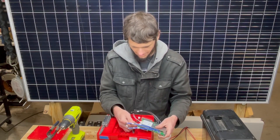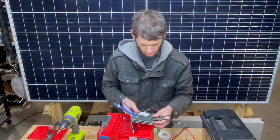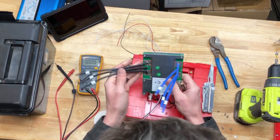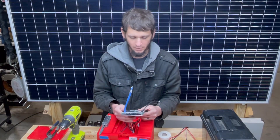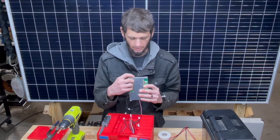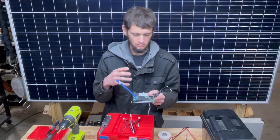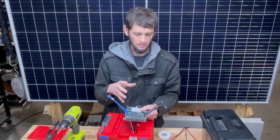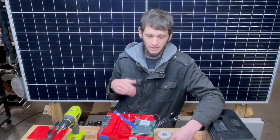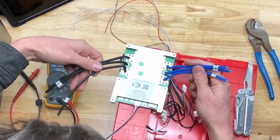Okay, so now I don't think this BMS will boot until the B-minus is connected. With these BMS's — and this is a lesson in BMS's in general — B-minus and C-minus. You can see it's labeled on the circuit board. This is what's called a common port BMS, so current in and out of the battery flows through this BMS. You've got MOSFETs — one row for inflow of current, one row for outflow. You can control only outflow or only inflow, so if you're at full charge with an inverter connected you can still pull power, but the BMS won't allow power in. There are also what they call separate port BMS's.